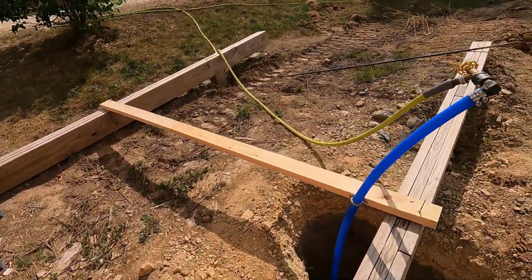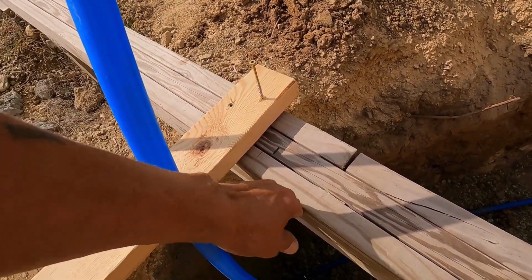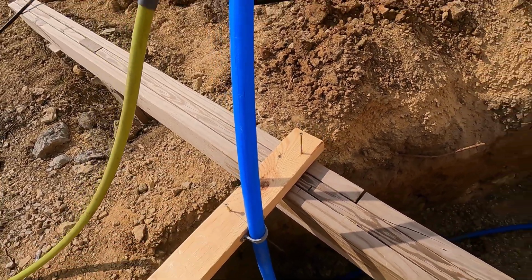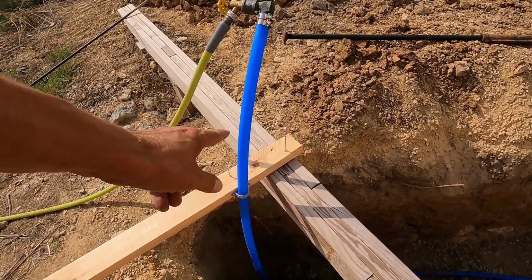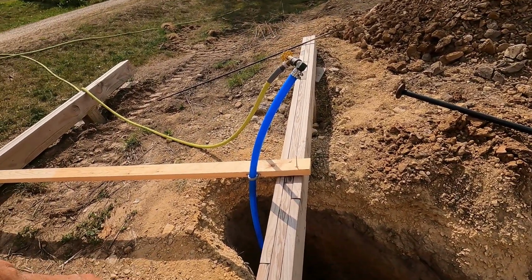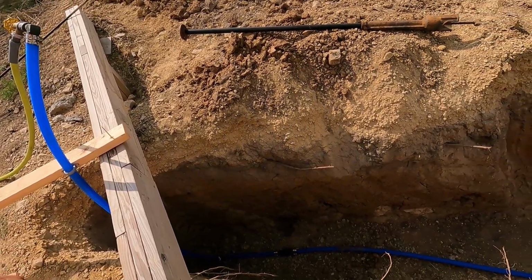That has insulation around it. That'll come straight up here, and the insulation will be attached to here, and when we have a joist in here, it'll be attached to the joist. So I'm going to have to figure out how I'm going to do that. I'm going to have to leave part of it off so I can get a joist hanger in there and then glue that part in later on. I'll get it figured out tonight, and we'll continue on this tomorrow.